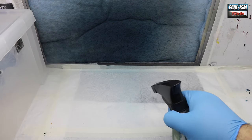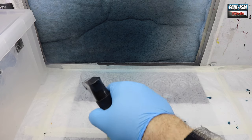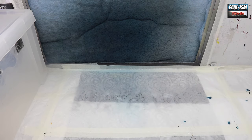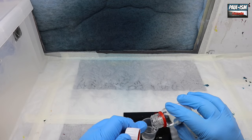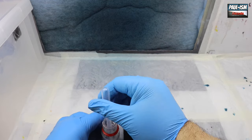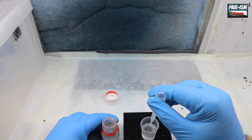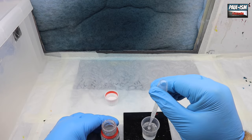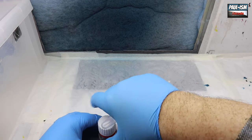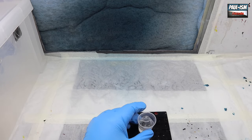That's been left to flash off overnight. We're in the booth and we're going to 2K clear coat it now. I'm wetting my work surface with some clean water — that way if any dust lands on the tissue, it will stick and not get airborne again. Dust is our enemy with 2K. We're going to use ProScale Paints 2K clear coat. This is a two-to-one mix — two parts clear, one part hardener. So we're putting in 10 millilitres of clear and we need five millilitres of hardener activator. That pipette is single use — once you've mixed this, throw it away. Don't reuse it and contaminate the other bottles.